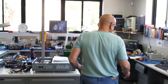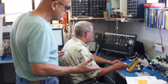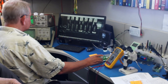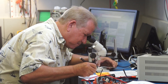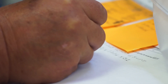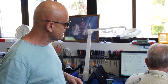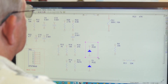The degree of miniaturization with these types of products requires special equipment to work on. As we spoke earlier about that 400-volt HVAC controller, this is the board that came out of that little device. Al is examining these parts under a microscope so that we can get part numbers of discrete components, values on diodes, resistors, and capacitors — which you can't see with the naked eye. Then we develop schematics, which allow us to repair this type of product.